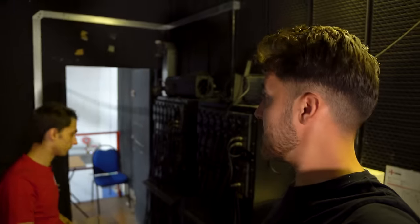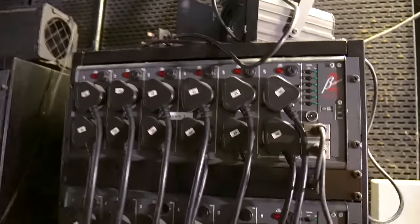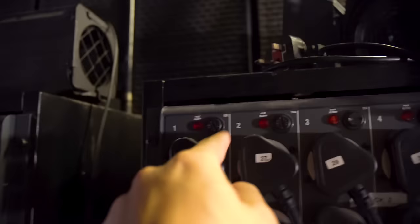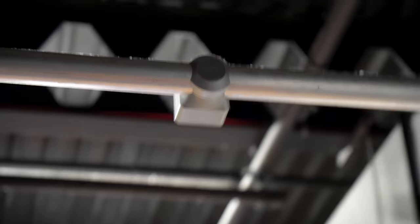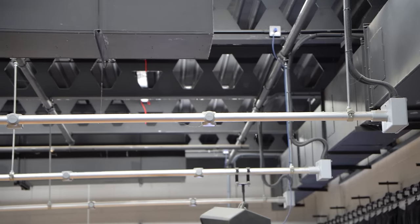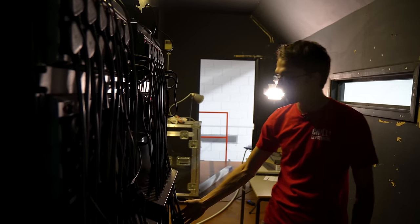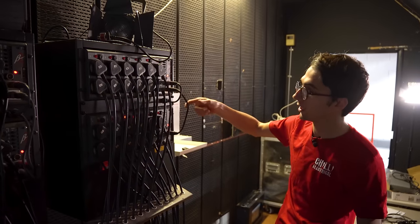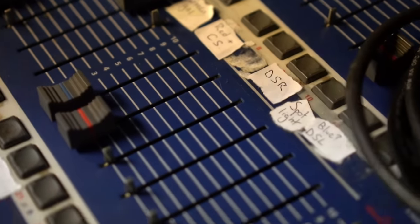So we're doing something called DMX lighting — Digital Multiplex. The way it used to be done: each one of these dimmer racks has these channels on them with their individual fuses and these are numbered. The flex would then come out of that, run off, up along the trunking, out on these balconies and over to these sockets here. So socket 26, whatever number it might correspond to, corresponds to the number on here. So we're going to bypass these basically and just send a switched feed to all the lights, but you can see the DMX connection here. Each dimmer rack has a DMX line going through it and then it comes back to this really old-school 088 DMX console. This would even work with the new lights, but obviously it's a bit old — we're going to upgrade it for something a bit more 21st century.